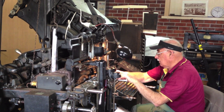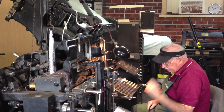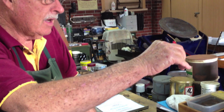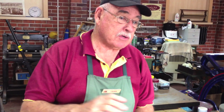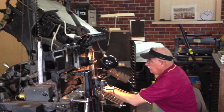So I've just set there for you guys: 'Now is the time for all good men to come.' Where I'm setting, I'm bringing down brass mats like that, and you can read the word on there — 'Come.' On the other side, those letters are embedded in the brass to make up the word. And the lead is going to be forced into the top line to cast the characters on the slug. The bottom line is exactly the same but it's italic, so I can set the line in normal type or italic. In this case it's just normal.